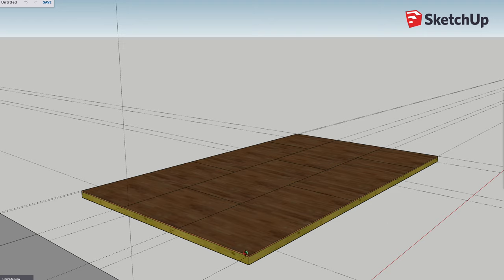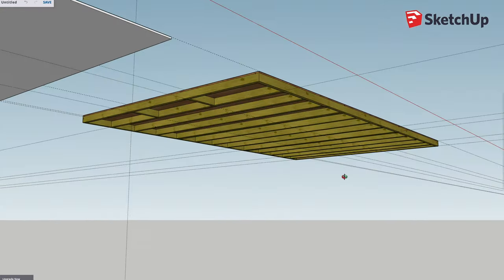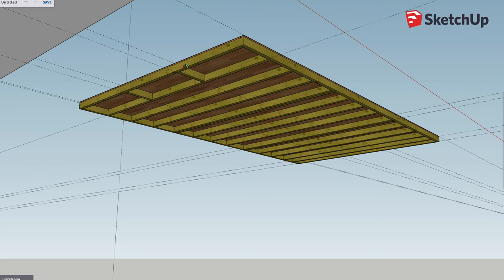It's the original design, this, because I originally planned for it to be 20 foot in length by 12 foot. But financially I said I can stretch just that little bit more. So we're actually going to go for 24 foot in length. So where there's half a board cut here, it'd actually be a full board. And then underneath, we're going to have treated 6x2s, which I've only got one set of joinings here, but they will go right across the frame.